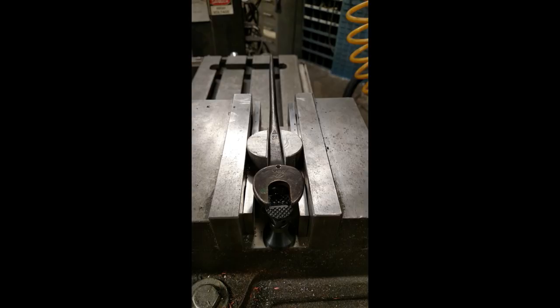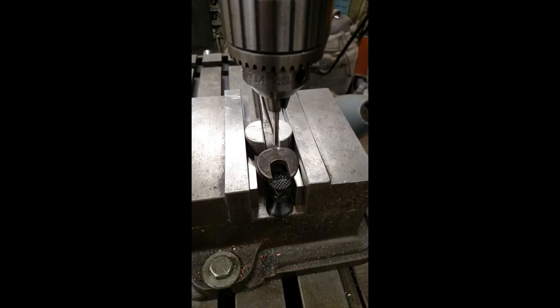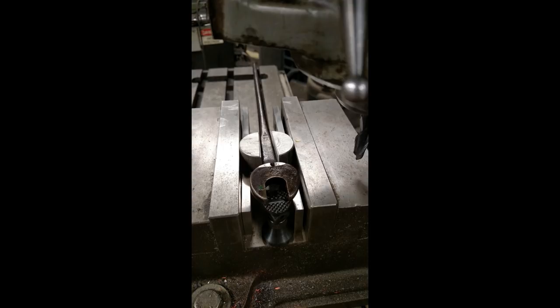In this particular case I had to drill and tap a hole in the back side of this wrench that didn't go all the way through, so that we could attach it to the plaque from the back side. The wrench was held at such an angle so that when it was screwed on, both the business end and the small of the tapered end would contact the wood of the plaque. Since I was drilling and tapping into an angled part, I went ahead and milled a small flat there just to make it a little easier on the tools. I ended up increasing the size of the flat afterwards just to make sure it sat on the wood more securely and didn't dig in.